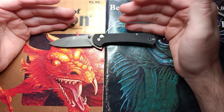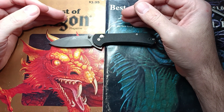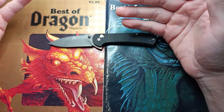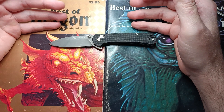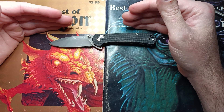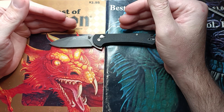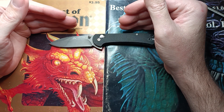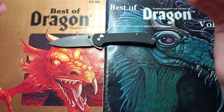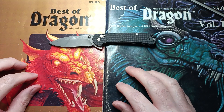This came from me not knowing what I was doing and asking people online. The first time I used the Work Sharp I sharpened at 22 degrees — it was like cutting with a hatchet. I asked people online and averaged the answers out to 18 degrees. If you've got a fixed-angle sharpener, by all means go nuts — I'd recommend trying 18 degrees and seeing where it takes you. If you're freehand sharpening competently, you already know so much more than I do. Also, make sure you can strop — diamond paste on your strop is a game changer in itself. If you already knew all this, feel free to feel superior, because I just now figured it out.